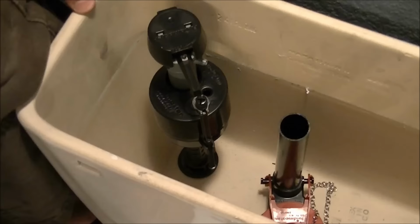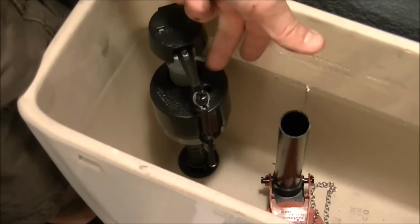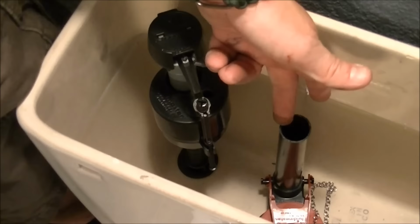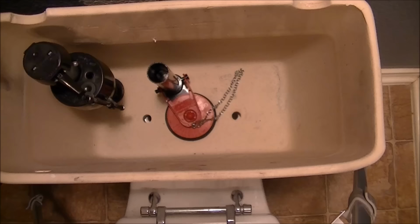Okay, there's the orientation I have inside the tank. You can see that the fill nipple is right there, facing towards the actual overflow pipe. There's a little nipple right here, and it's going to have a tube, and it's going to go over to this. It's not in the way of the actual screws at the bottom, so you can still tighten those up. And that's the next thing we're going to do, is tighten up all the securing screws inside the tank right at the bottom there. Okay, so I've lifted the bowl up and it's now loosely on top here.